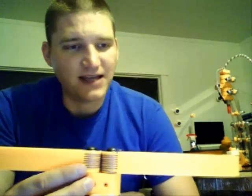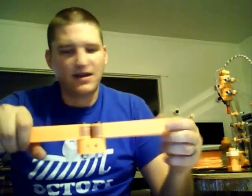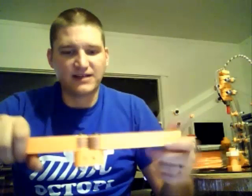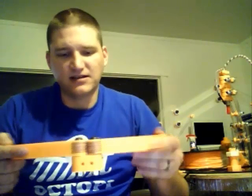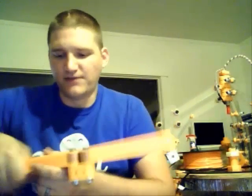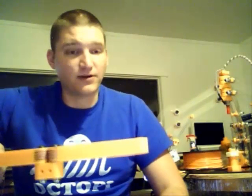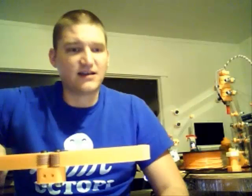I've tried to bend it with my hands and I can't. I grabbed both sides here and tried to tweak it back and forth, up and down — you could probably see just a little bit — but I'm putting tons of torque on this. Whenever I'm printing something, it's gonna be light and wispy, and it shouldn't be an issue. I should have hardly any sag. I've put this in a vise and pressed at the end, and for any reasonable force that a 3D printer will actually have, it's not a measurable displacement. So everything's looking like it's gonna fall into place.